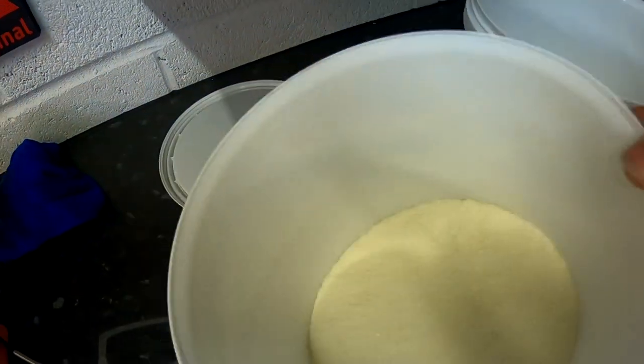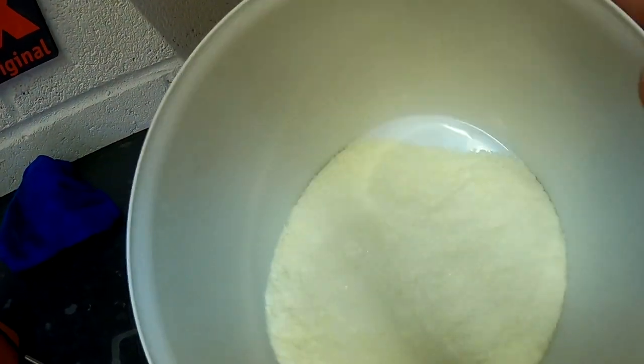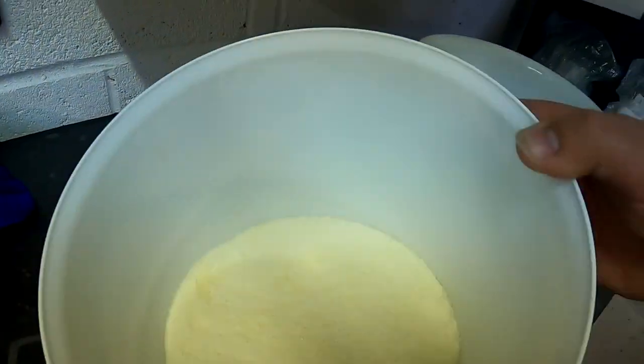The next one, I call the goat cheese wax because it stinks like goat cheese. This is another crystalline wax, Montan wax. Again, a very hard wax that is not hydrophobic, but it's very glossy. It's kind of similar to Carnauba, but a purer looking wax. It's a very brittle wax, and you need to balance it.